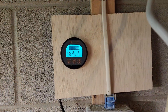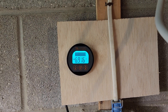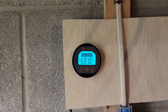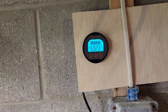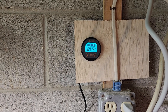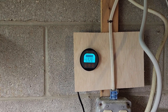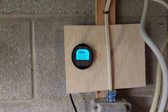So if I want to know what's happening to my battery, the net effect is 6.9 amps going into my battery — that's what's left over after the 7.8 amps delivered to the grow lights. The battery is charging while a load is on the system because the load is less than the power being generated.